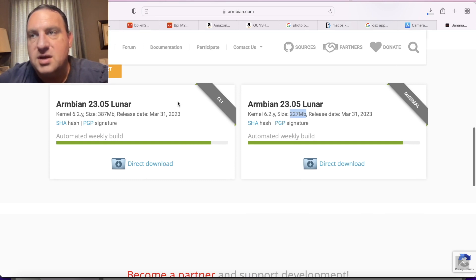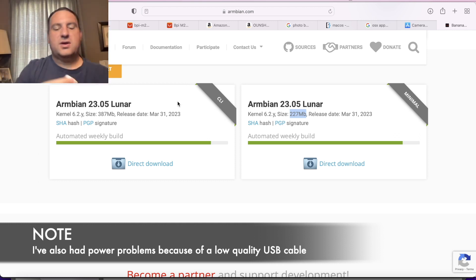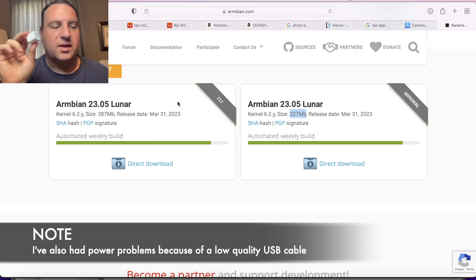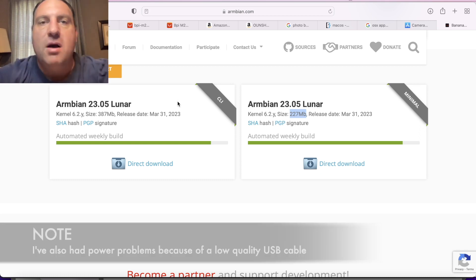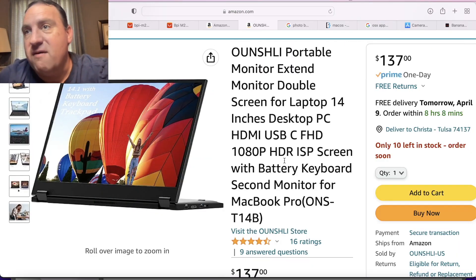In a minute I'll boot this up and show you what that looks like. A few things to note: the BananaPi will not turn on the display driver if it does not detect a display when it boots up. The two issues I've had are: one, the power supply wasn't giving enough juice — that's happened even with power supplies I thought were big enough. What's worked really well for me is just a straight Apple power brick; these work like champs. The other thing is having your monitor on before you plug it in, because these will go into sleep mode after about five to ten seconds. So you have to turn it on and immediately plug in your board for them to work.